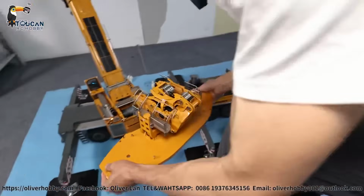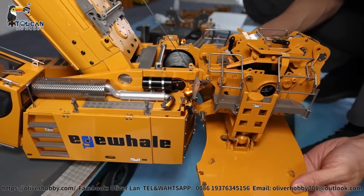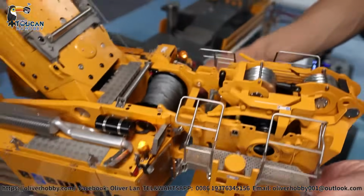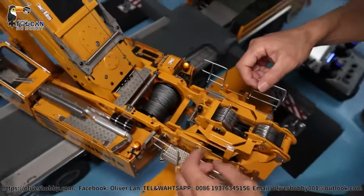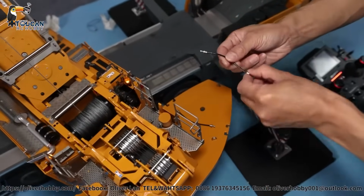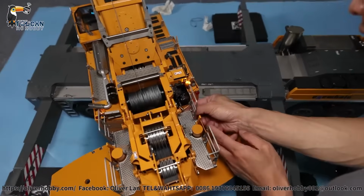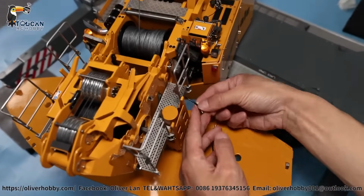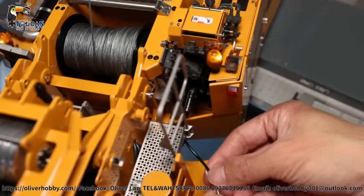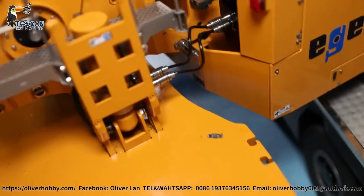First these 2 pins out, then align with top to hook, bottom align this pin, push in. Push in. Okay, now it's ready. So we will connect these two holes to raise it. Then we can put here for normal operation, yeah. To raise it so we can have the position for rotation to connection. That's quick connection, it's easy. Okay, it's connected. Now we will raise it.